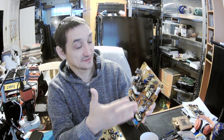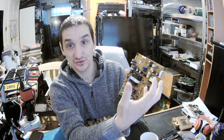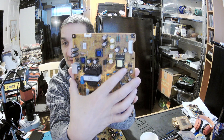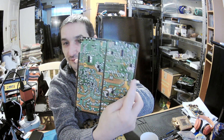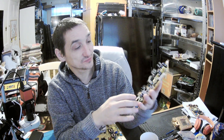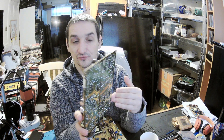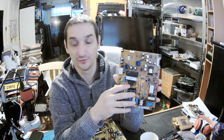You see, the similarities are there. And then the opto-isolator, when you press that button, will send the information back to this part which is live. There are lines here, you see, across this power supply. On this side you've got these lines as well — from here you can go to there like a maze, and that triggers probably this chip, or there is a second chip. One of those chips is responsible to start the main transformer and send the backlight power and the full power to the main board. It's the same principles, no matter which power supply.